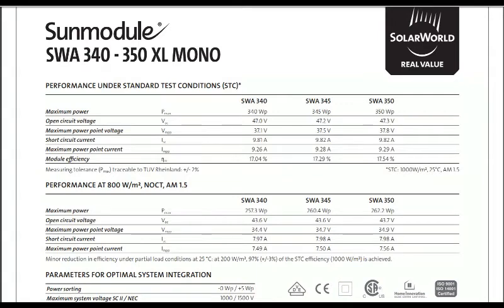These are the three things you're looking for on a datasheet: you want to know the open circuit voltage so you can configure your voltage when putting panels in series, and you need to know the amps, because when you put series strings in parallel you have to add up the amperage. These are very important numbers.